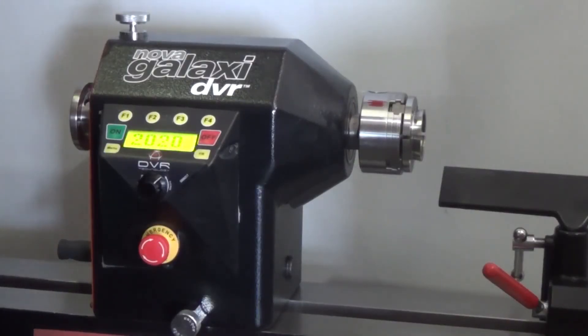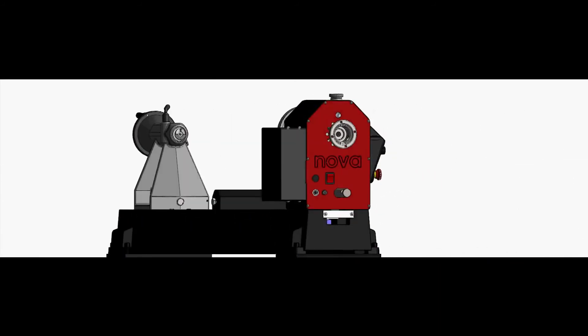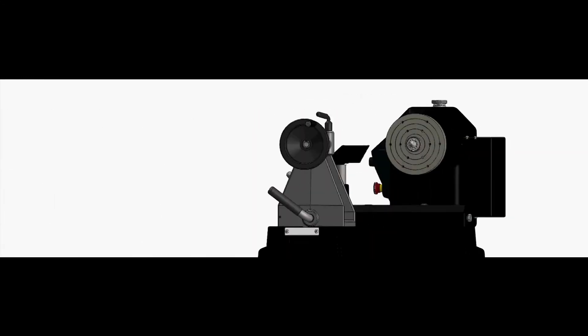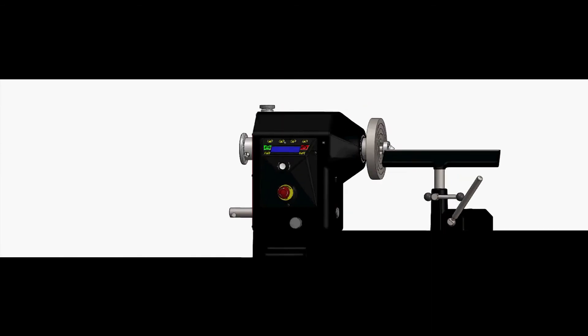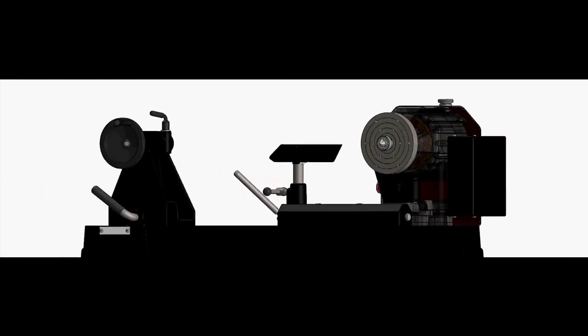Like many other applications, for decades machine tools were only evolved by changing designs and bolting on sensors. But the key to the technological sophistication of these products lies in their most operational parts. The transformational features in the NOVA Galaxy are the direct result of a powerful switched reluctance drive system operated by an intelligent control system. The revolutionary composition of power and intelligence is called digital variable reluctance. The motor itself is of the simplest construction — there are no brushes or electrical connections to moving parts, and it's free of permanent magnets.